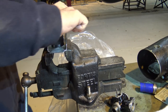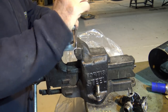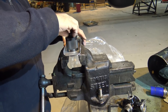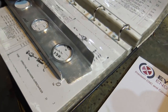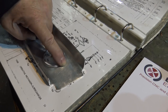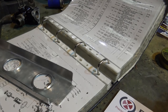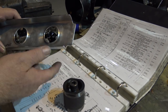I'm trying to see if it's level. That's gone quite stiff now, I can't actually do it anymore. What's it — the noise or the knocking you were objecting to? My cathedral calm might be disturbed. There you go, that's it. That has to be cleaned up — that's the end point. Now if there were any little tiny scratches or anything in there, it could cause it to knock. Does that come through to 90 degrees? No. I think the production ones are much stronger, but you can see you can't really go that far. It bottomed out. And it tends to splay these a little bit as a reaction as you bend that up — so you just have to knock them level again and polish that up again.